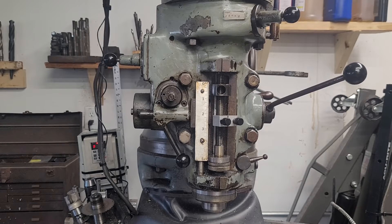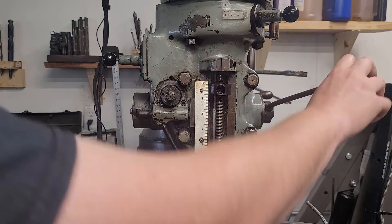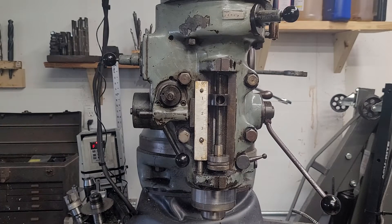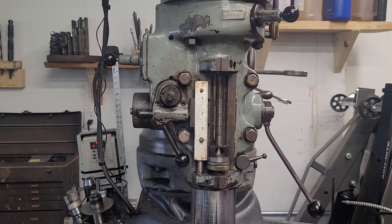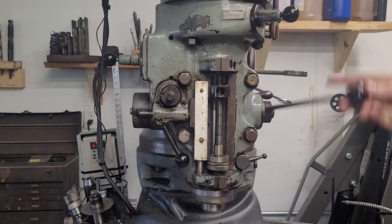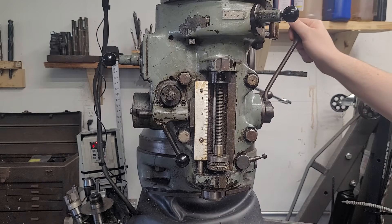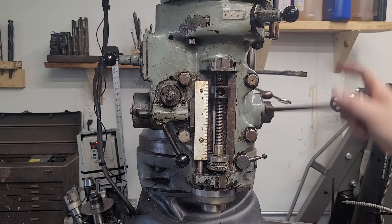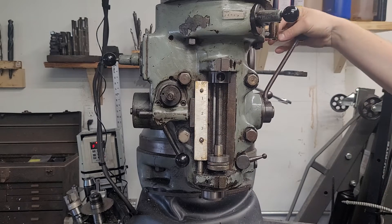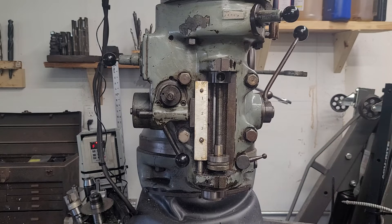You do have a full five inches of quill travel, which is quite nice. These make a pretty decent precision drill press or a very low precision jig bore — we've got plenty of travel, and a reasonably beefy spindle. These are meant to stop. Don't adjust the clock spring so it brings everything up under spring pressure — that will cause issues. If the quill is particularly stiff, there's a set screw on the back of the quill, or these four bolts might be too tight. If you have a round-column machine, don't try to use these four bolts to correct your nod — use the four bolts on the turret casting or turret base.